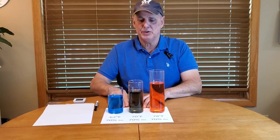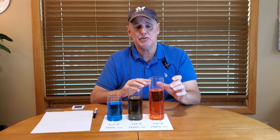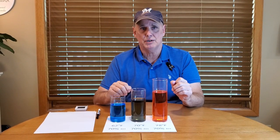The point here is the warmer the air is, the more moisture it holds. Even though you're saying 'it's 70 percent relative humidity, I'm in great shape,' your air is much more moist at 78 degrees than it is at 70 or 64. So let's see exactly what the moisture difference is.